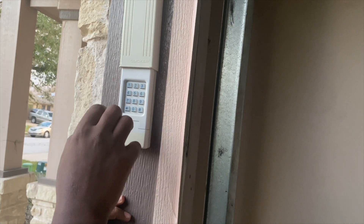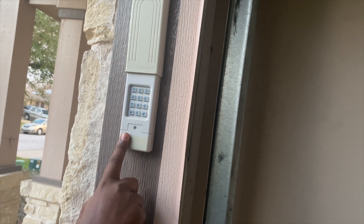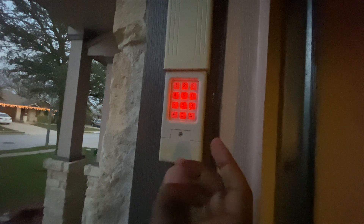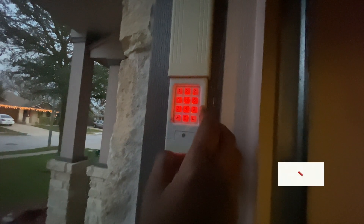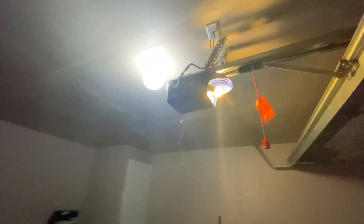So I'll start by entering my PIN — I'll use 1-9-5-0 — then press the pound key. Now I'll enter the ID, which is 9 for the Wayne Dalton opener. Then I go to the garage opener and press the program button. Now the keypad and opener are about to connect.